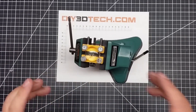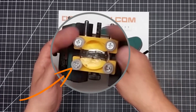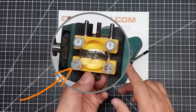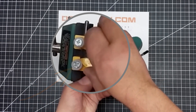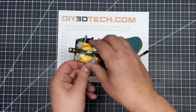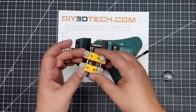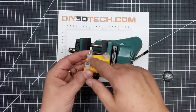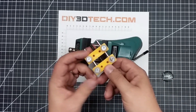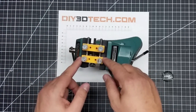The other thing I like is you can 3D print different jaws for this. I don't have them at the bench right now, but I purchased a couple of these clamps and did up a set of jaws for circuit boards. Basically I did up a square one, cut it out so the board would slip in, and the four corners lock the board into place. Then I can set it into this vice and solder the connections to it.